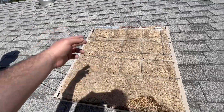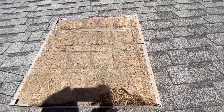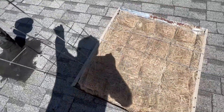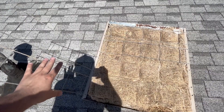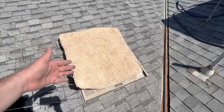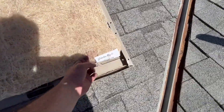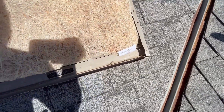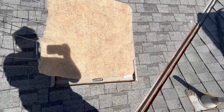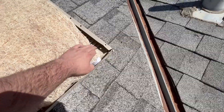Repeat this for all of them — pull down and up. For the top one, pull up and up. Be careful because these are sharp. For the new cooler pad — they're rectangles, so make sure you have the width and height in the right orientation. I like to put the little tag down at the bottom since the water trickles down from the top and I don't want it splashing out.